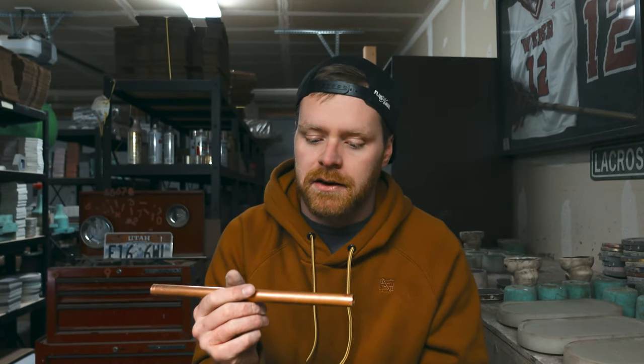Even half a millimeter off, it's not going to be snug. Also, with the silicone shrinking over time, I've got to make it a little bit tapered so I can fit it in over time, over multiple pours. So let's get that going. I've got to do some little practice cubes just to see if I can get the whole diameter right and the taper right. So that's the next step.